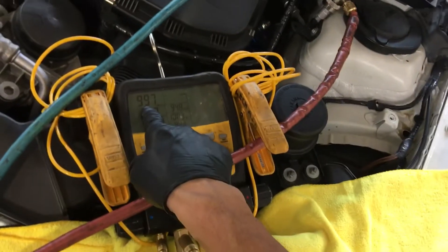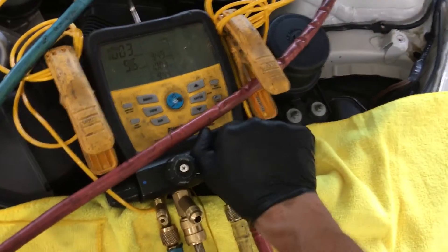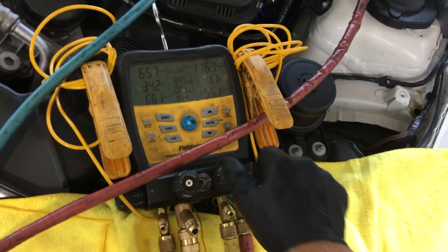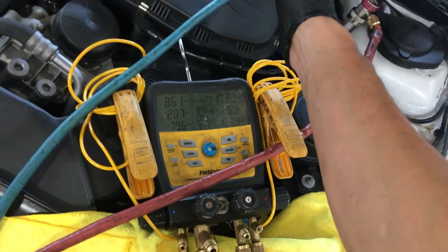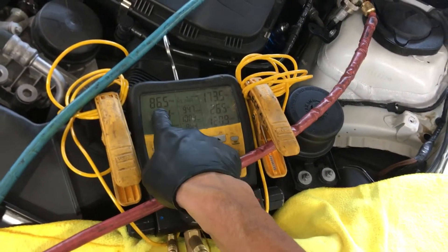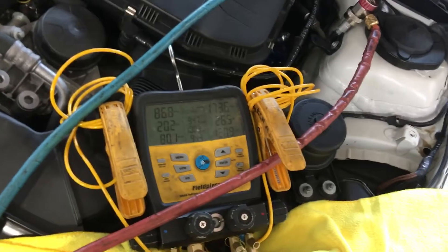We're having some decay right now and I'm also reading the decay of the hoses. Let's give it some gas. Now the high side is where the nitrogen is going through — I'm slowly opening it up. Because of the hard shutoff and the spring pressure to overcome, it will not go over to the low side all the way. See, it's stopping at 86 — like a dead stop, no matter how much I put in the high side. It is stopped. So we're at 173 psi.